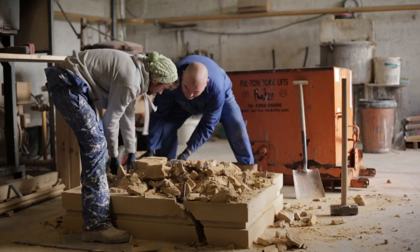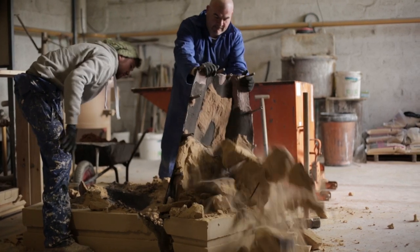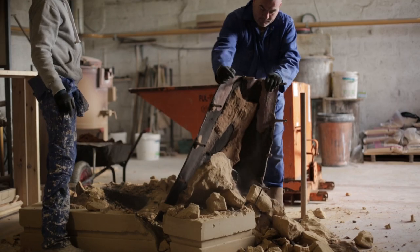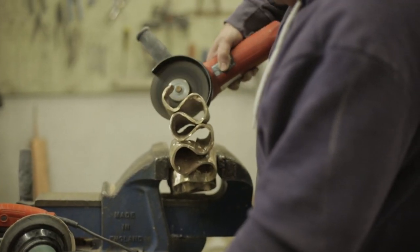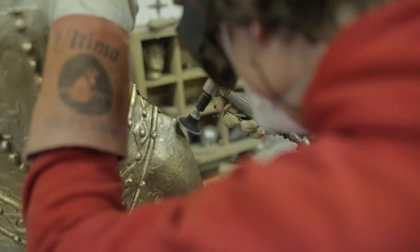The runners and risers are cut off the cast bronze with angle grinders before the stubs are cut back to the surface of the bronze. The stainless steel nails are pulled out and the holes are TIG welded closed. Other tools used in this part of the process include a MIG welder, cutters, grinders, a chisel with a flat texture, a matting tool, and die grinders.